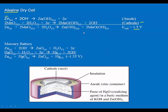You might wonder why an alkaline battery would cost more, but the thing that's significant is that the voltage performance is more stable for an alkaline battery. So I could just draw a diagram here, say this is voltage and this is the amount of time that you draw a certain current from that battery. In an alkaline battery the profile looks something like this. That wouldn't be exactly right, and this is meant to be constant along here, but when the voltage drops off for an alkaline battery, it drops off relatively quickly. The old-fashioned battery profile, the one on the previous page, I'll try to start at about the same voltage, but then it just sort of phases out with time.